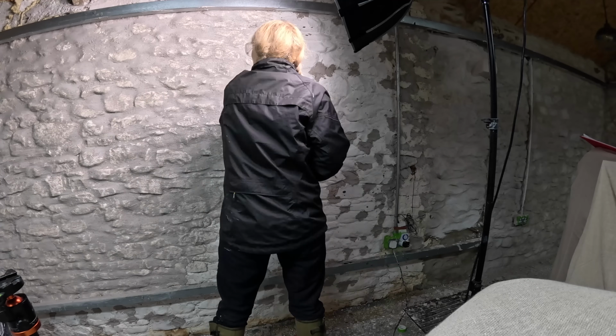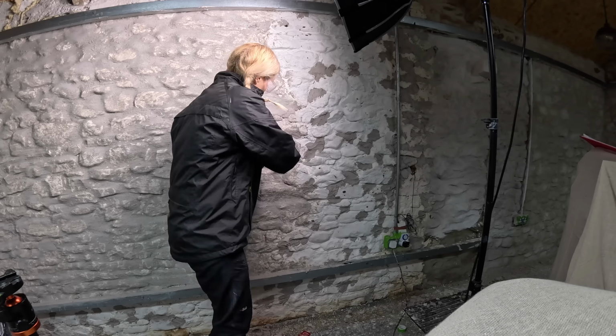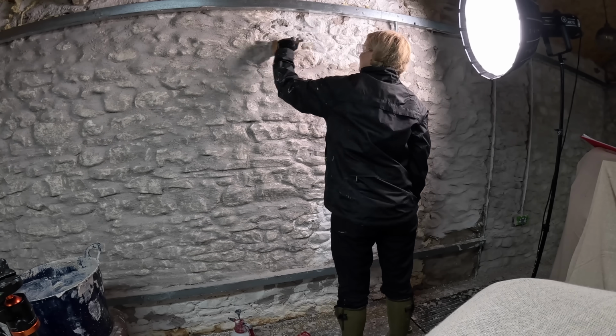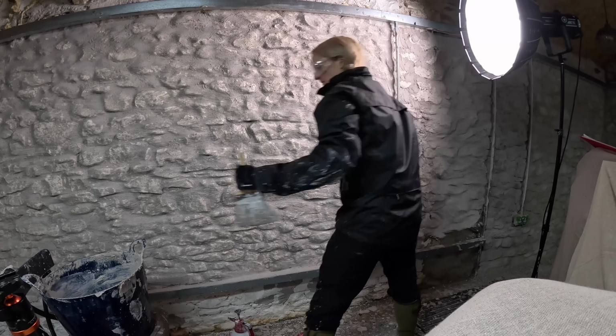It's worth pointing out that another benefit of the lime is that it's softer than cement, so it gives and flexes with the wall over time. In a way it's a sacrificial part of the construction because you want the mortar to crumble before the stone fails if things get under pressure. That's why these repairs are needed and why holes appear in the wall in the first place.